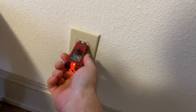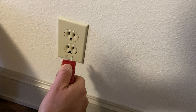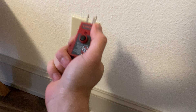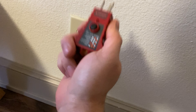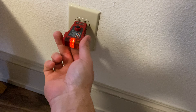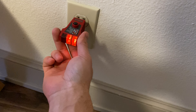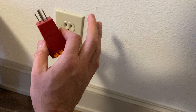If you don't have this tool, go through every single non-working outlet with this type of plug tester, or you can just use a lamp — a desk lamp, whatever you have. We're going to look for a sign of flickering, or on this tester we'll look for lights that start flickering when plugged in and don't stay on.